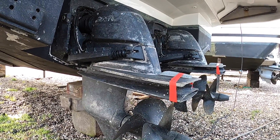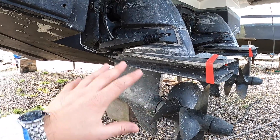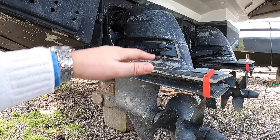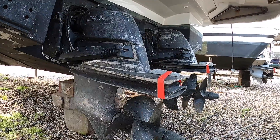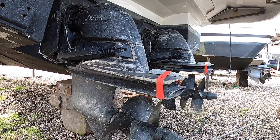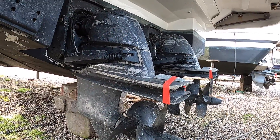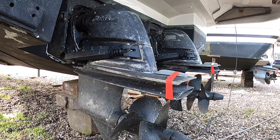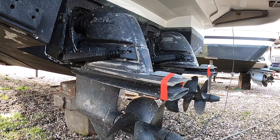In essence outdrives are more efficient, better packaging, faster — but you've got more maintenance. A slight disadvantage is it puts the weight of the engines right at the very back of the boat; it's not quite as well balanced as a shaft drive boat where the engines are further forward. They're known as the devil's egg whisks because of the problems you can sometimes have, but generally speaking they're well proven and a good system. You can have these as single or twin, as indeed you can with shaft drives.